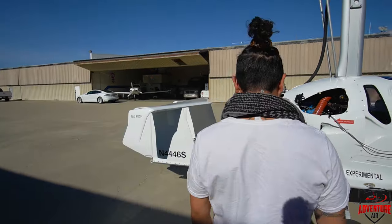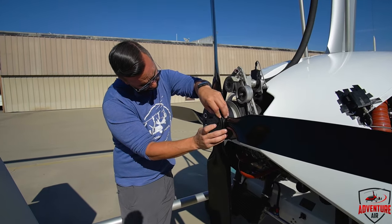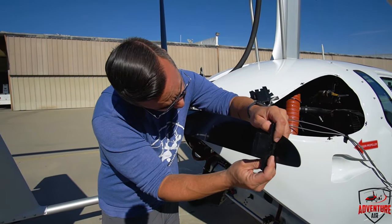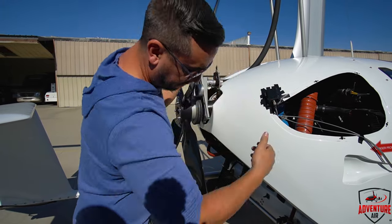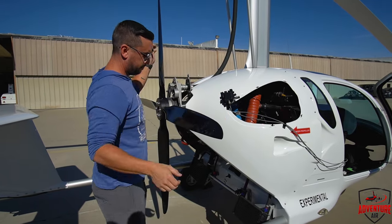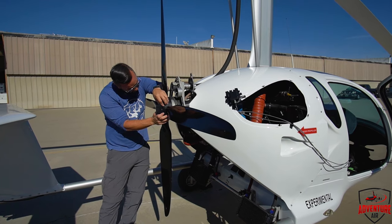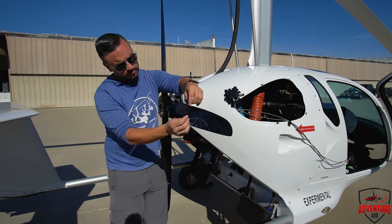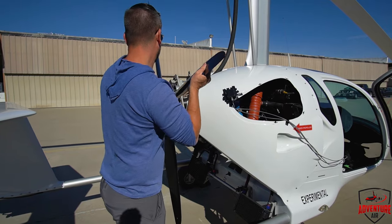That one I got was right at 18. So you achieve the center, the zero from the hub, and then you go to a precise point in the blade so all the measures from each blade are in the same position. Even a little bit — because we're talking about point something — it will create vibration, and those vibrations in the future can alter the good behavior of the machine.